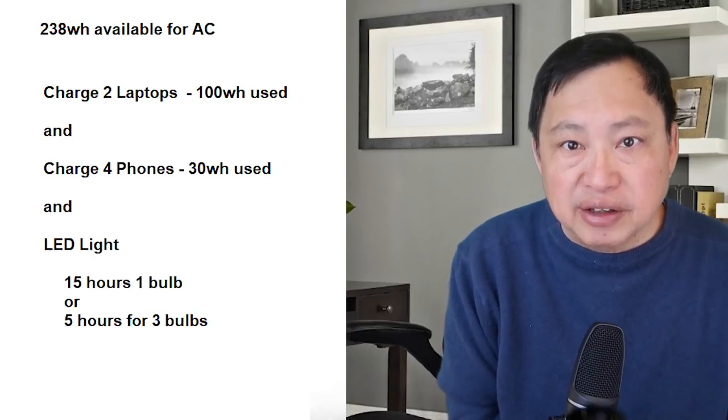If I wanted more amenities like a cold drink, I'd need another separate set of solar panel and battery, plus an additional solar panel — and that should give enough power during the summer to run a mini fridge 24/7. In winter climates you don't need this, so you'll have reserved power. My prior computation showed the 300-watt power station fully charged can only run the mini fridge half a day, so the extra solar panel accommodates that extra needed power. If the grid is down, or you want comfortable camping, having a pair of Rock Pals solar and battery sets will be downright luxurious — though you'll have to cook without electricity.